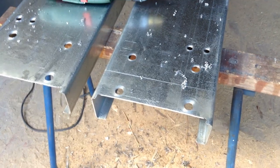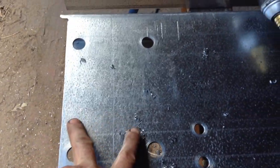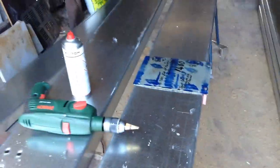We were going to do these holes with a rotary broach, but I thought I'd give the step drill — like a beehive-type drill — a bit of a try. And it's absolutely mowing through them, no dramas. These are great for drilling purlins. Get a good quality one. So we've got our mounting holes and our holes for the brackets for the girts. Our drill jig is getting more and more holes in it — holes for a relief cutout at the bottom, the four main mounting holes, and the mounting holes for the girts, because we've got lefts and rights. So that ensures all our holes are on centre and in the right place.